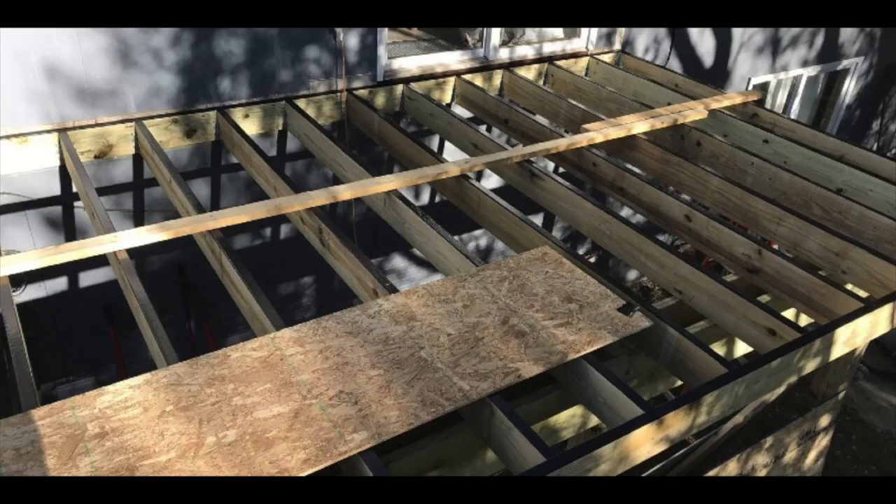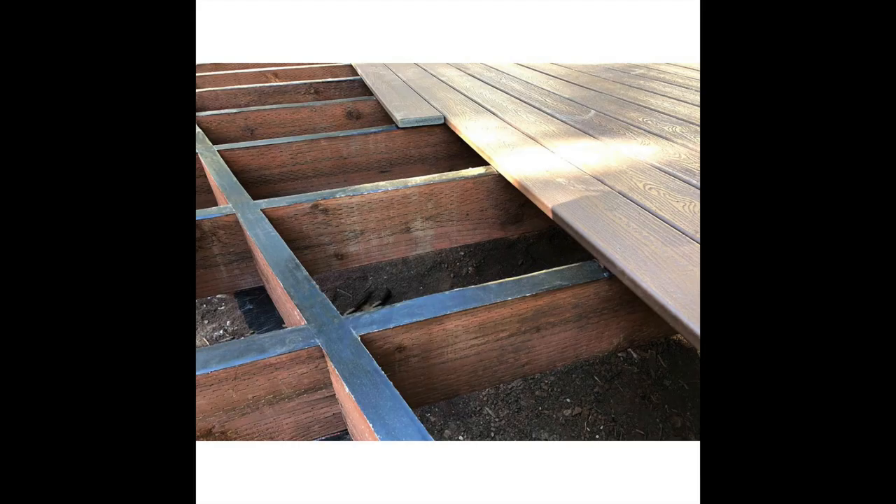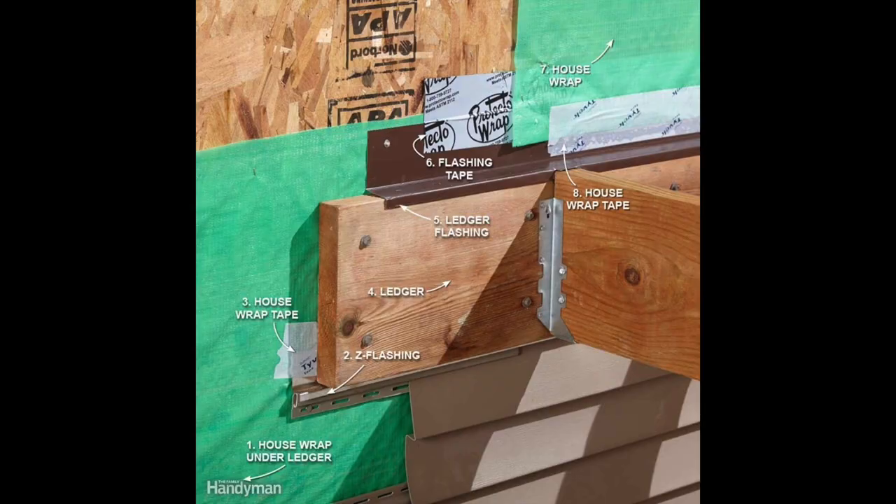While the primary purpose of soundproof joist tape is to use it on the floor, some people also use it on the ceiling and walls. This is because it can act as a bit of a decoupler between the studs and the drywall, which helps out with soundproofing as well. Now obviously it's not the same as actual decoupling where you would have something like a resilient channel, but it does add something between the subfloor and the joist or the walls, creating not a full decoupling but a cushion. And that cushion, if applied everywhere, really helps with squeaking and the audible sound of footsteps.